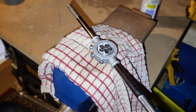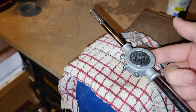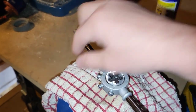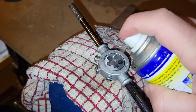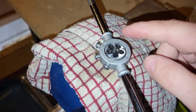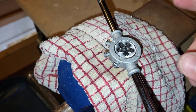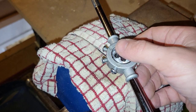So I'm in my workshop, which is my loft space, and I've got a little vice here that I'll just put the little gubbins in. I don't want to mark it, but I'd prefer it doesn't get any marks on it, so I've given it a spray. I've just about got this M12 one from school — from memory, I haven't done this for quite a while. The most important part is to get it on straight, because it will cut no problem, but if you do it at an angle then the thread is going to go at an angle — so spend some time trying to get it as straight as possible.